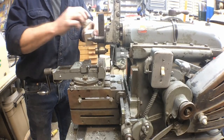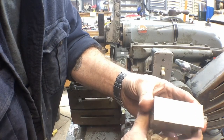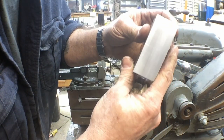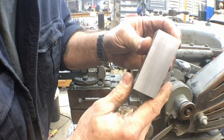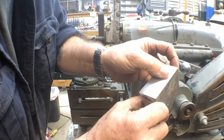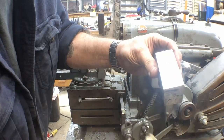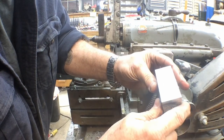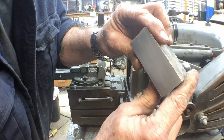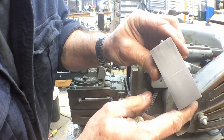I did want to show off the surface finish on this a little bit. Look at that shine — I'm pretty happy with that. I've got a few little tool lines across it, but for what this machine is intended to be used for, that's a really, really nice finish on a piece of aluminum. I can feel them just barely. There's a little line right across there, but I didn't even bother to hone that tool before the final finishing pass and that's a pretty nice finish. That one little tool line in the middle is the worst of them.